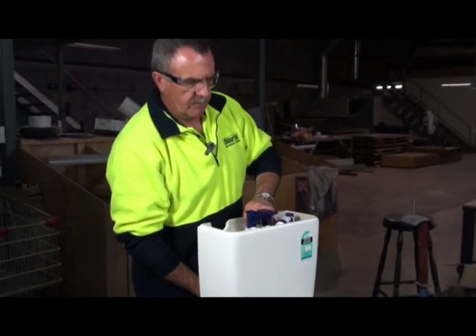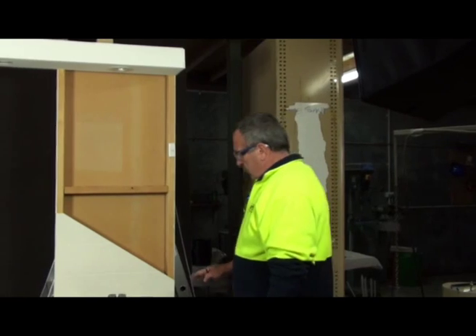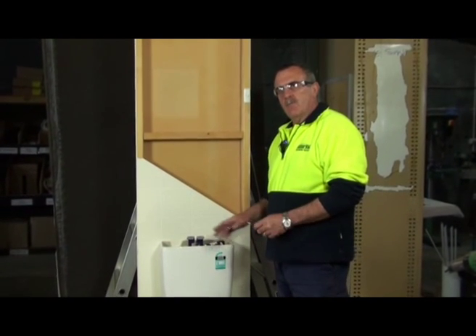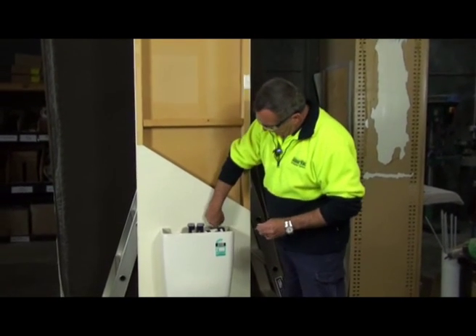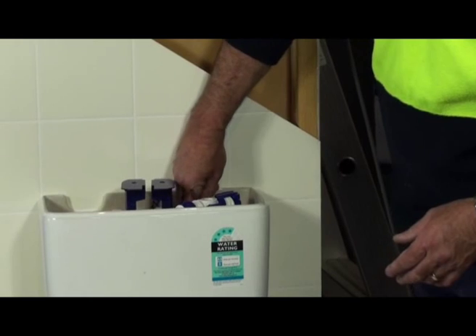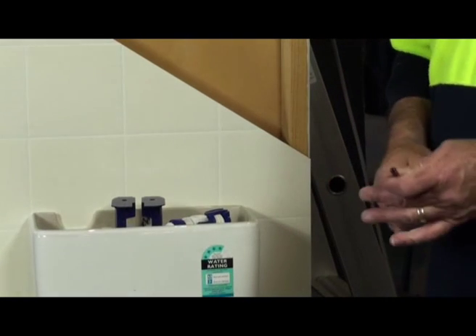Then you're ready to attach it to the toilet and determine where your hole is in the wall. Once you've drilled your hole, put all your toilet together and position it where you've predetermined regarding pipes, sewage and all that. Lift the lid off the top and you'll see where you've drilled your hole. For the OVK2 kit, just get a pencil, texta or pen — anything you can mark with — and just mark a mark on the wall. Once you take the toilet away, it'll show you exactly where you need to be.